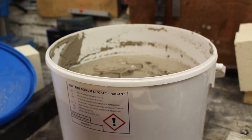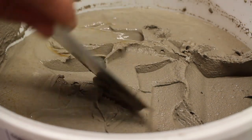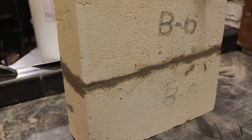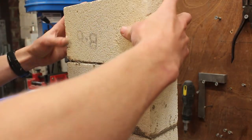The next step is to start gluing the bricks together and I'm going to be doing that using this refractory mortar. This is a brand called Pro Set 2. This refractory mortar can go up to 1400 degrees Celsius so it'll easily be good enough for what I'm doing here. I first glued each individual side up and when I'm doing it it's important to try and keep the bricks as straight as possible because that's going to help with the assembly.